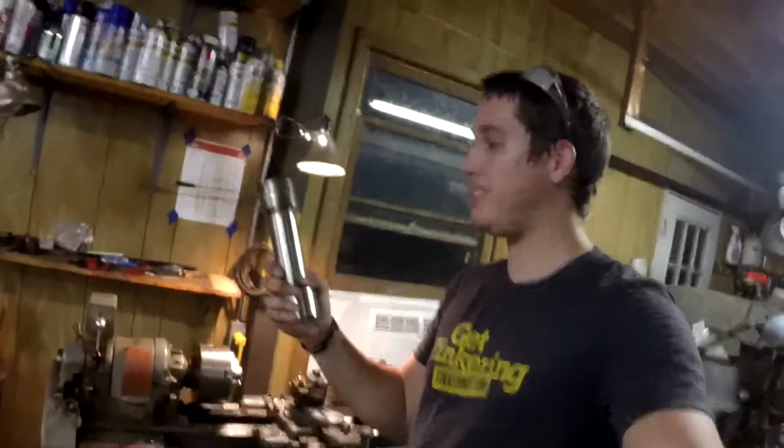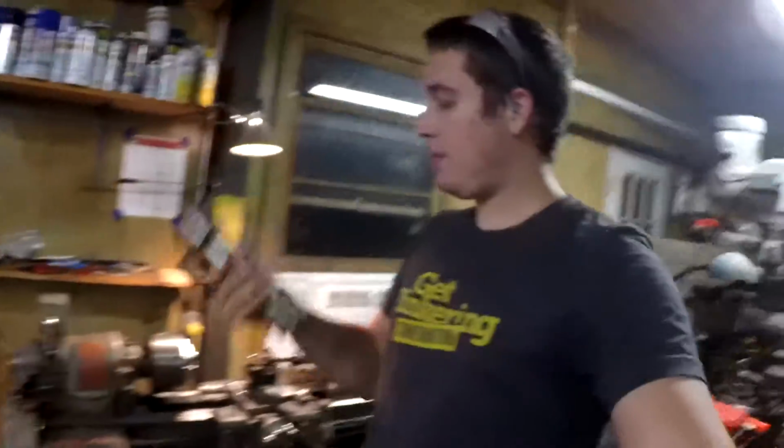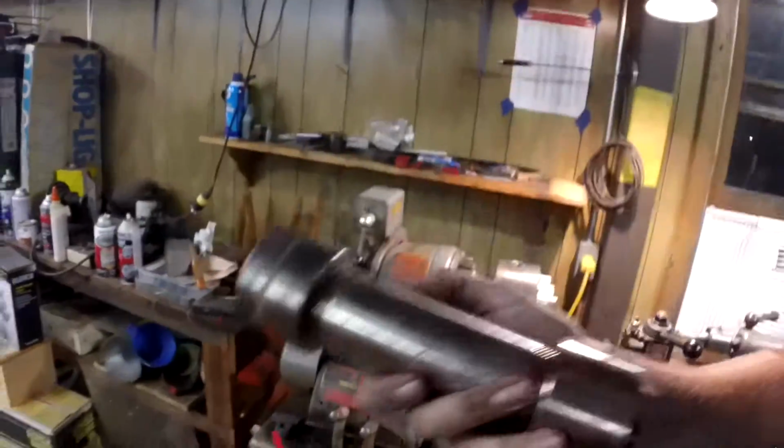Alrighty, so far what we got done on the tank is we have the 4 sides welded. We have the inlet and outlet for the fuel made, and the 2 holes in the tank drilled. Now we need to actually make a fuel fill. The way we plan on doing that is I stumbled across this piece of stainless steel in the scrapyard, and it conveniently came with a top and a good body to work with. It's a huge chunk of stainless, which is exactly what I need for making a stainless steel gas tank.